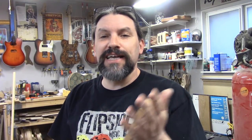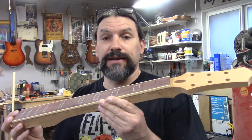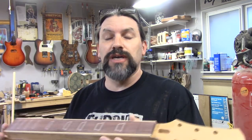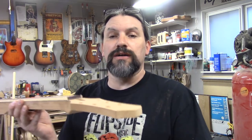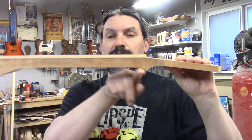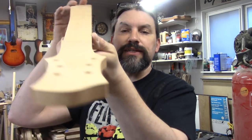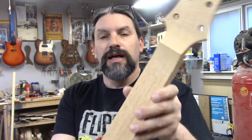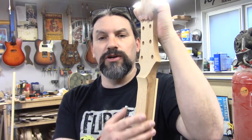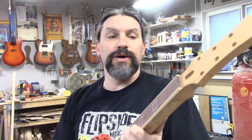This is going to be part of a series of videos about how we take necks from where they were when we first started to ready to glue into the bodies. I was thinking about doing that in one long video but I hate editing really long videos, so we're calling this good. To wrap up: today we removed a bunch of material from the bottom of the headstock and the bottom of the neck, and ran it through the old man machine so the headstock is more or less the proper thickness. Next we're going to chuck this into the jig for the pin router to establish the contour on the back of the neck.